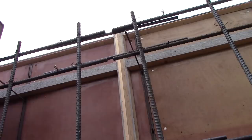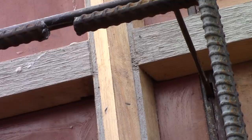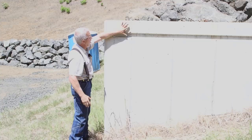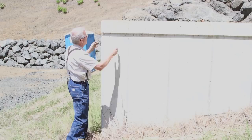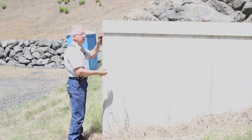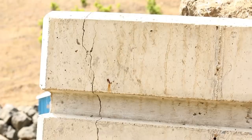I've got this reveal — I mean it looks nice, right? It looks like there's a cap sitting on this wall. I should have run this vertically down the outside of this corner to create a control joint on each side that would have made it look like a nice column standing here. That would have made real good sense. But I didn't. Since an inside corner concentrates forces, and this was shrinking in two directions while initial settlement was pushing down on the entire wall system, it cracked.